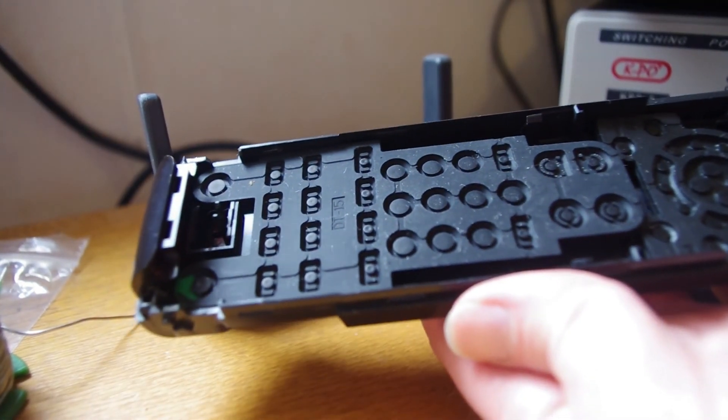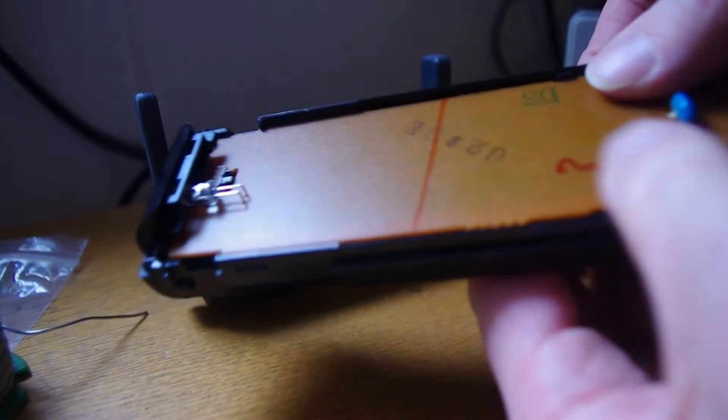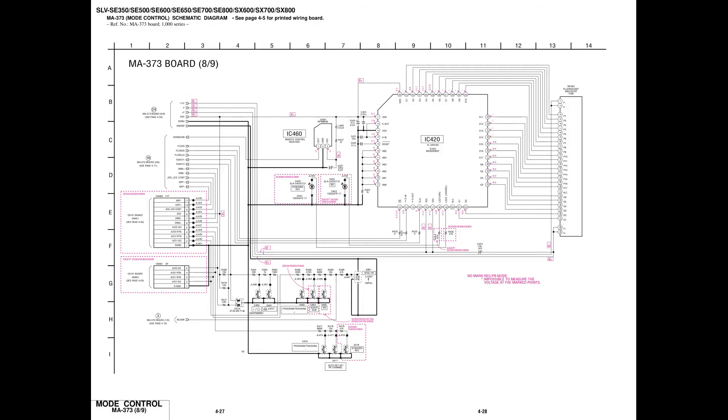In a lot of cases this will solve the problem, and if you've got an oscilloscope you can confirm this. In my case it has not solved the problem, which will probably lead to a part two of this video. But let's consider the other options. If the remote itself is working without issue then the problem is likely on the receive side, and the receive side on most equipment is really quite straightforward. Looking at the schematic here we can see that the IR detector has very little in terms of extra components around it. However, we do see one electrolytic capacitor again, right across the supply VCC and ground. One of the common failure modes of electrolytic capacitors is a low resistance or almost a short — if that's the case here it will be dragging VCC towards ground. Maybe once the component is active this effect increases, stopping it from receiving any further signals, which would correlate with what we're seeing.